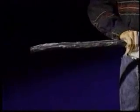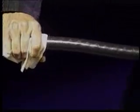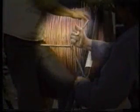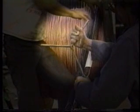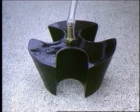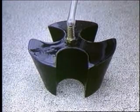After the pull, Polywater lubricants are easy to clean from the cable — simply squeegee down the cable with a rag. Most of the lubricant is removed in this one quick step. Another important point is the use of a cable separator when pulling three parallel cables. The cables should be arranged and controlled on feeder tube entry; if not, the cables adjusting over one another in conduit bends can produce very high tensions. A number of devices are made for separation. One separator also lubricates the cables by allowing lubricant to be pumped through holes onto the cable as it passes.